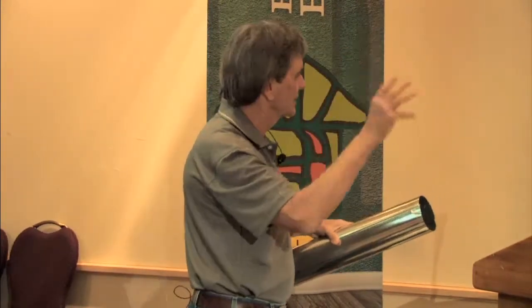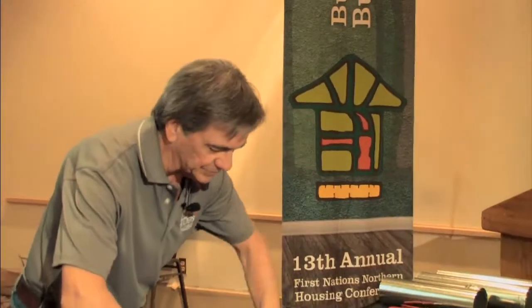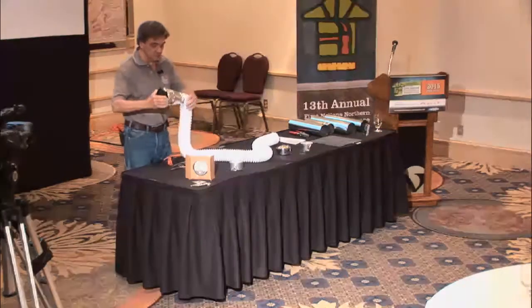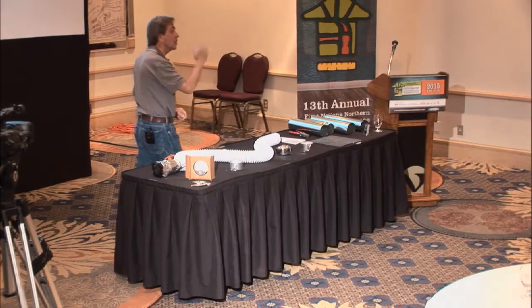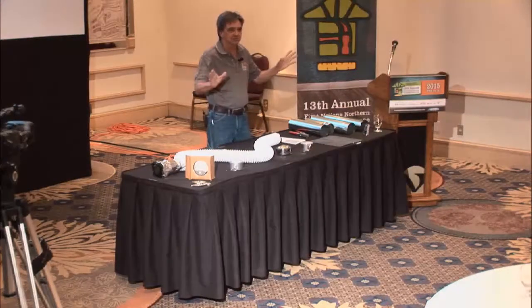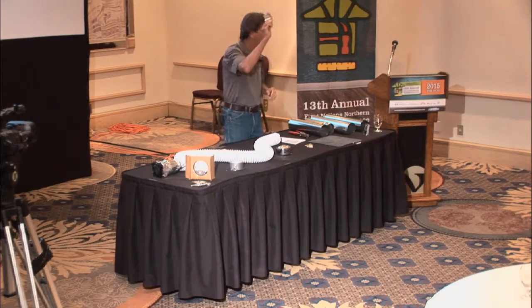Why is that important? You saw the air leakage here. Well, in many, many installations, we're finding as much as half of all your fan pressure is lost through those holes. The air leakage is just losing the pressure. Well, you say, I myself used to say, it's not so bad. The furnace is putting the hot air out, and it's getting lost in the walls of the house, so it's warming the house. I'm not going to worry about it. It's not like going through the attic or going through the basement. It's in the house. The only problem is it's not getting to the grill. So it's not getting into the room where I needed it to get to, and it's not getting there with the same pressure and speed that I'd hoped for, because it lost that along the way.